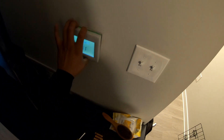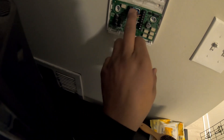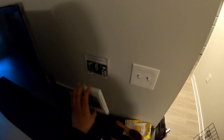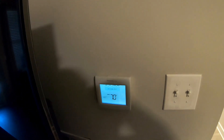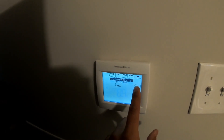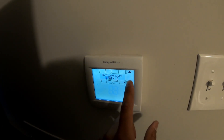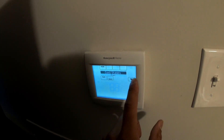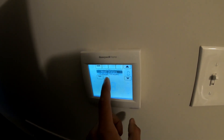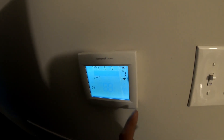This time around I took my batteries out of my thermostat. If you wire it correctly — red and blue wires with a jumper on RC and R — this thermostat will power up without batteries. I kind of like it that way: if something's going wrong with the unit, it kills the thermostat. Go back into installer options, throw that four-digit code in — it's for the installer, not just anybody. Then go down and test the heat. You can test heat, cooling, fan, and emergency heat in there, but we're just testing heat.